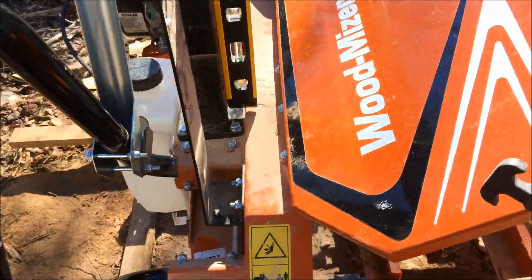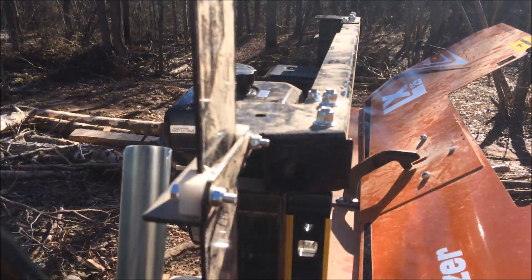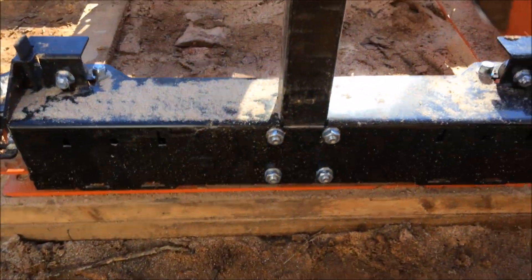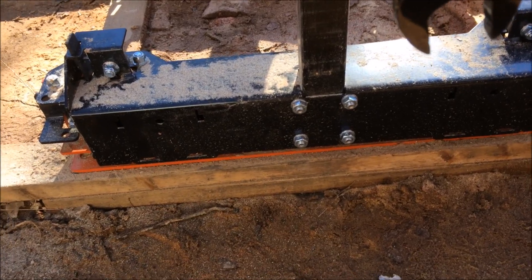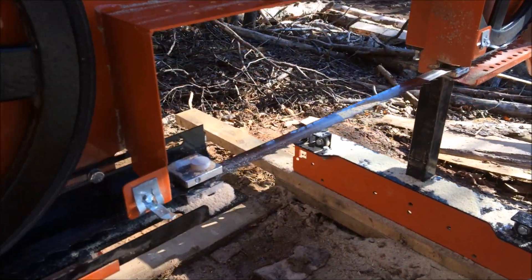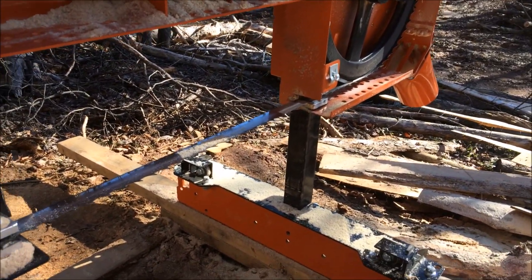The next thing is, if you're having wave problems or irregularities going in, make sure your pedestals are level. This is the pedestal that the blade rides on. Make sure you put a bubble level on them — both sides. Mine was off a little bit. I had to loosen the nuts at the bottom and bang on it at the top. Mine was actually tilted back just a little bit, so it had a tendency to cut up. If the pedestals aren't straight, the saw blade is going to come in at an up angle to start with. That's critical to the way the blade enters the board.